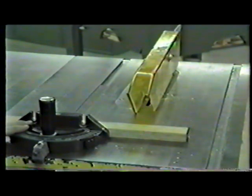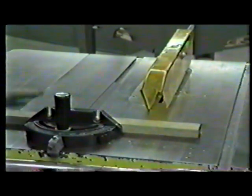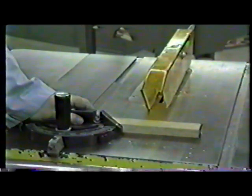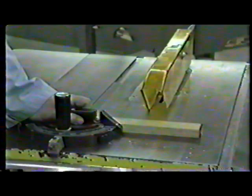So it's not a goof-proof machine. You want, of course, keep your fingers back 4 inches. You need to check to make sure nobody's behind you, behind the saw for kickback. And in most cases with a machine like this, when you use it, you have to ask your teacher each time, each and every time. Now that means if you use it and you shut it off and you go over to the bench and measure something or get something else, then you need to again ask the teacher before you use it again.